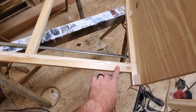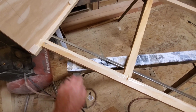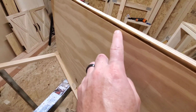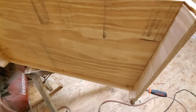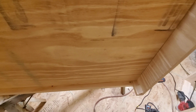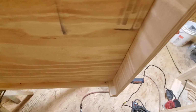Okay, I just got me a little bead of glue here on the bottom inside rail where this shelf's gonna go, and I'm just gonna go ahead and drop it in here. As you can see there, I got my groove that Luan back panel is gonna slide into. Pretty much fits pretty nicely actually. Pencil lines where I previously marked line back up. Like I said, I showed you the glue joint there.